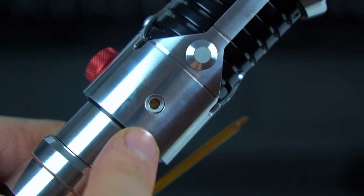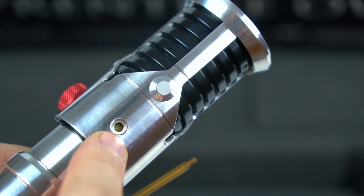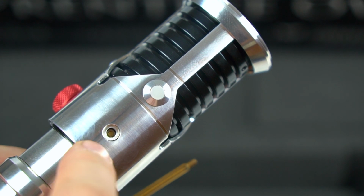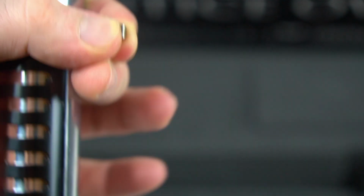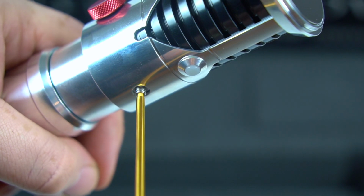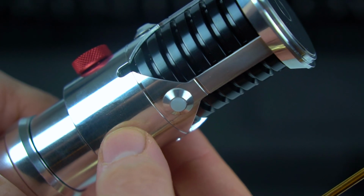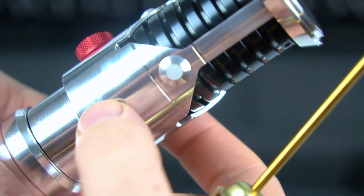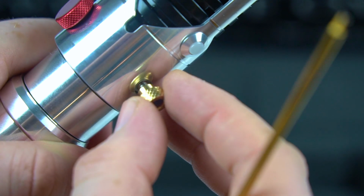So you can see, if you look very closely, the button actuator for the switch PCB just there. You see the gold. I've sanded the PCB till it snug fits perfectly in the center. Then you'll get that grub screw, which is in the bags, and you'll just screw it in like so. And once you start to feel it get tight, I'm happy with that feedback now. So I'll just do not too tight. I'm happy with that. And then I'll just put a bit of glue or Loctite on there.